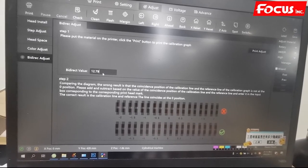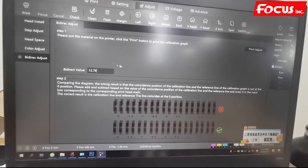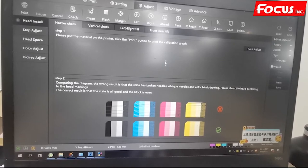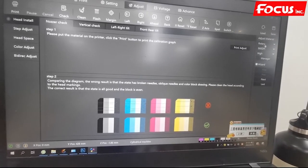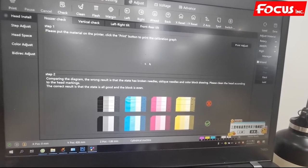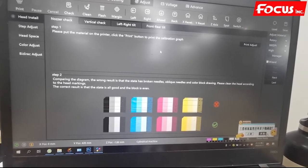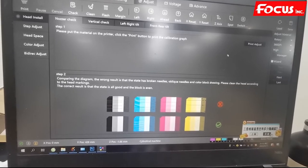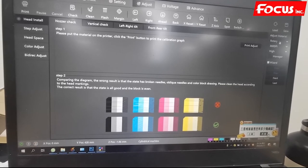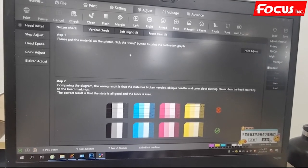But if you have overlap on the printer with bed selection on the bottle, you still need to change a little bit. So if you change the parameter from here, all the parameters are only used for the rotary material. So when we convert back to flatbed, the numbers will be changed back to the flatbed parameters as we set before. So that means these two suites of parameters, one suite for rotary, one suite for flatbed, we must adjust separately, unique.